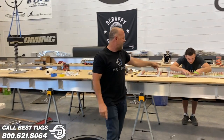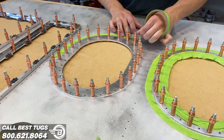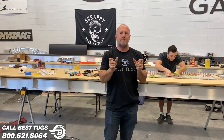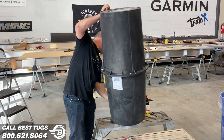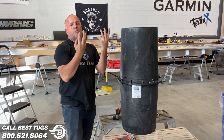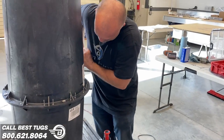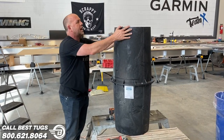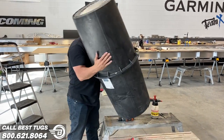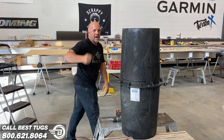We're already putting it together over here. Dylan's getting this done. He's taping off around everywhere. We're gonna bond the gas tank lid ring into the tank permanently, so we got a nice clean line around it. So we got a lot to do. I'm just riveting this together. Got half the rivets coming from one direction, half from the other. I've got a seal I put in there, squished it together, so this should be watertight. And the lid test on one side, a hole to fill it on the other. Finish riveting this together, let it dry, fill it clear full, back to work.